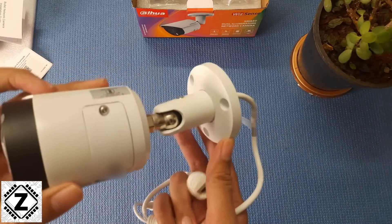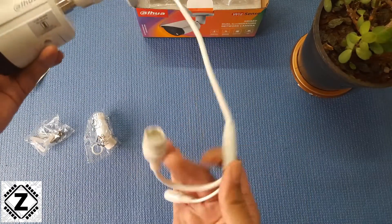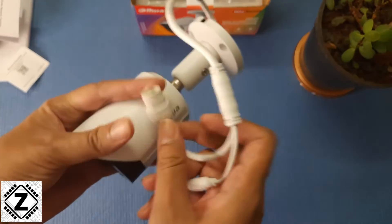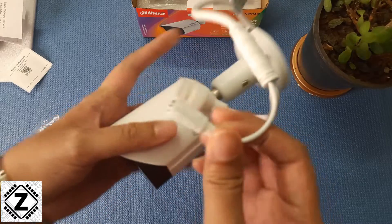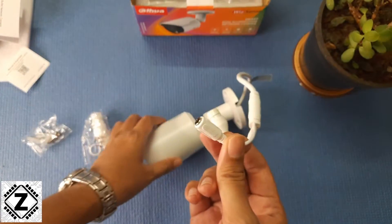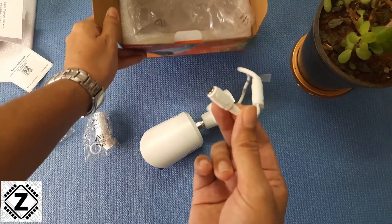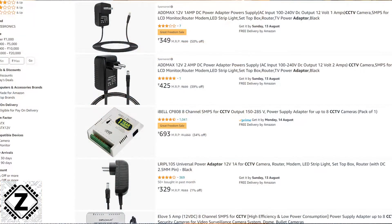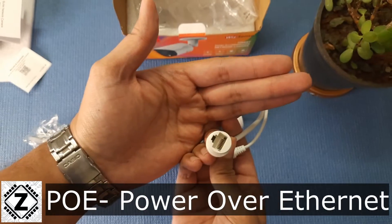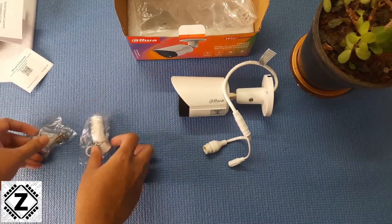The mount comes with three screw holes so you can mount it on the wall. Talking about the connectors, it comes with two: one is a regular RJ45 style IP connector and the other is a 12 volt DC barrel jack. To power this thing, you can buy a 12 volt adapter — the adapter is not supplied inside the box so you'll have to buy it separately. Alternatively, you can go with PoE, that is Power over Ethernet.